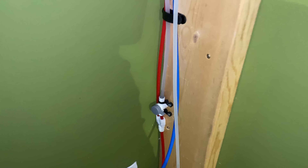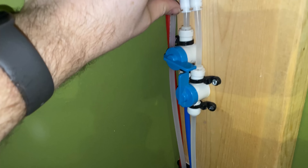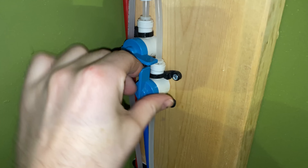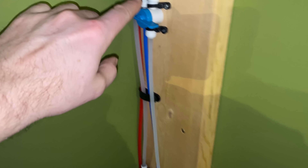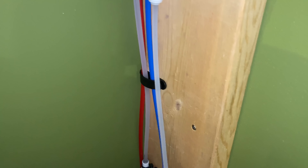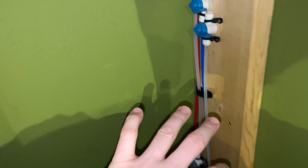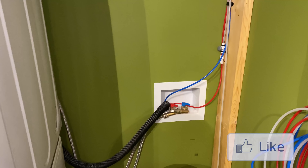So tons of flush valves — for a new filter, for the membrane, and pre-DI. When I first turn it on they all get a flush. For our product water output I currently have two valves — it goes into a splitter with two valves. One just goes to a really long hose so I can manually top stuff off for now. Maybe later one goes to the auto top off bin and the second one goes to the saltwater bin — we'll see.